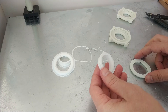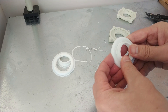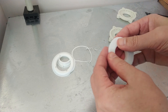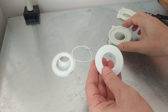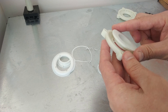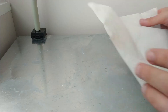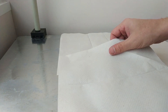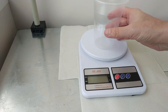The first method I will explore is the open method of pouring silicone into a mold. The uniqueness of the open method lies in its simplicity of filling and fighting the main problem: air. First, you need to fill each part of the mold separately and then connect both parts together. I design the mold so that it is possible to create an excess volume of silicone, which I will need to create a high-quality tire. I print the mold on an SLA printer.